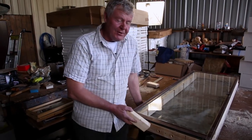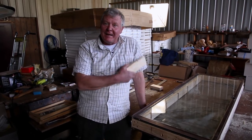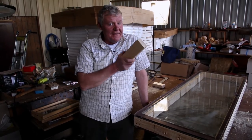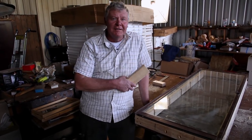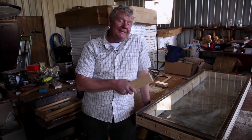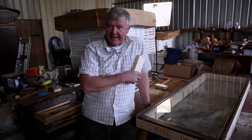Some rough individual didn't hang the door quite square, mind you. I didn't have any way to cut the hinge quite proper. So if I was to do this again, I would just get some individual hinges, because then you can actually adjust your angles better. With the big piano hinge, unless you're a professional, which is definitely not on my resume, you can't adjust it as easily. So there you go. There's a little hint for you if you're making one of these at home.